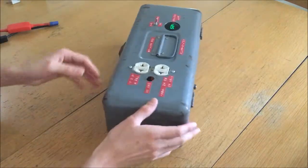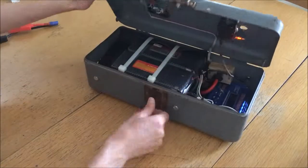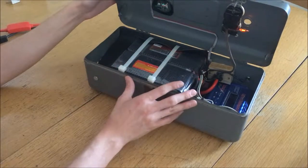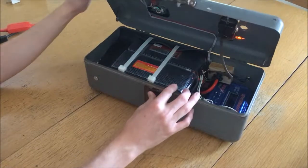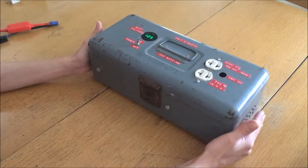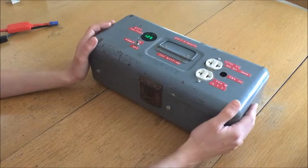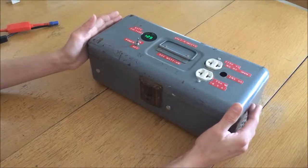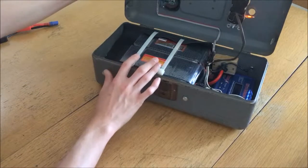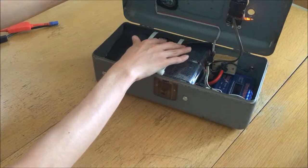It's made out of a metal box because I wanted it to be reasonably fireproof in the event of battery failure. If one of these batteries puffs up or vents flame, I want to make sure the box is not going to contribute to that fire. Obviously it's not the strongest box and the lid could potentially pop off or flame could exit through the side holes, but the point is to keep it somewhat contained in the event of a failure. You can see the bolts on the front hold the inverter down, and the lithium polymer batteries are mounted to the inverter with big heavy zip ties, with a bit of rubber for strain relief so the zip ties don't gouge into the battery.